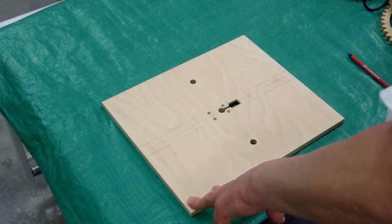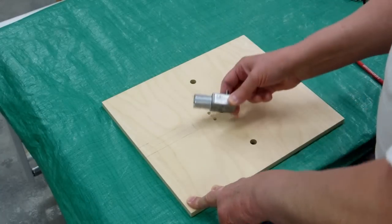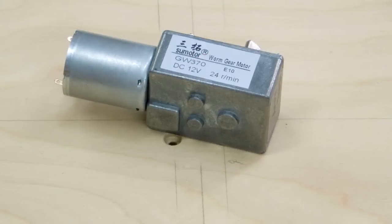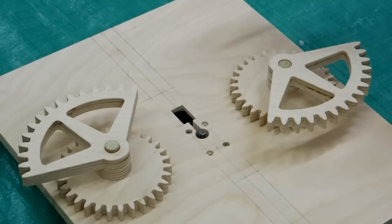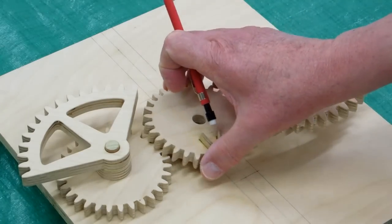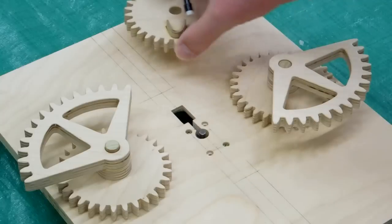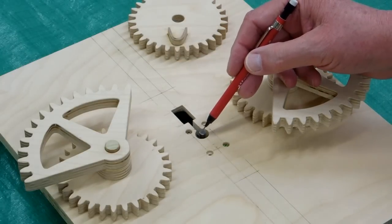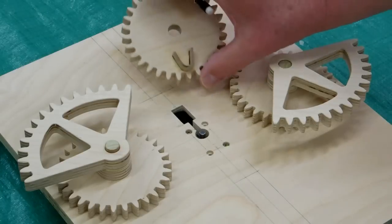I've laid out a new mounting plate for this movement and drilled some holes for a little gear motor bought out of China — a 12-volt gear motor that runs at 24 RPM. The motor is mounted with these two gears sitting in place. This is a six-millimeter shaft on the motor, but the driven center pinion has a half-inch hole in it, so I will need to make an adapter to connect the six-millimeter shaft to this gear.